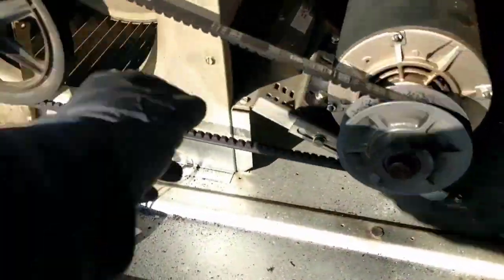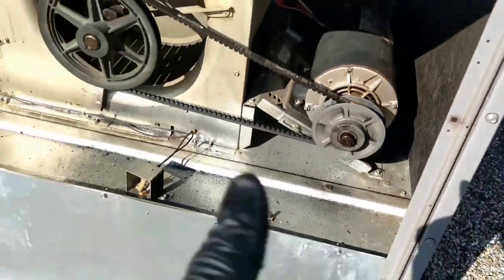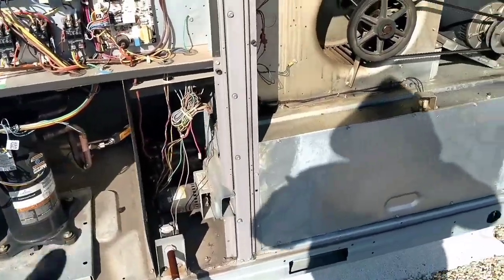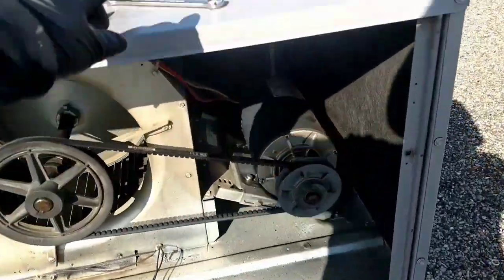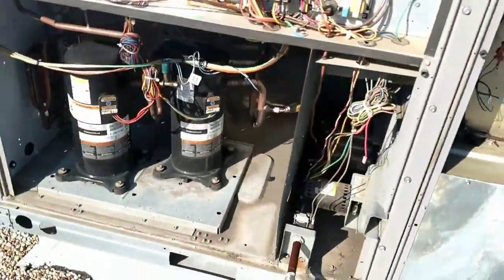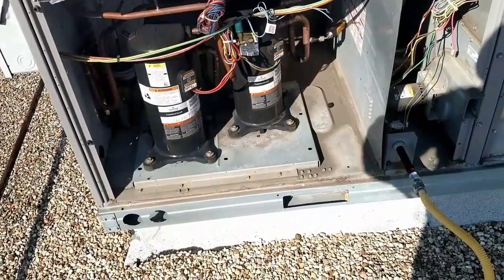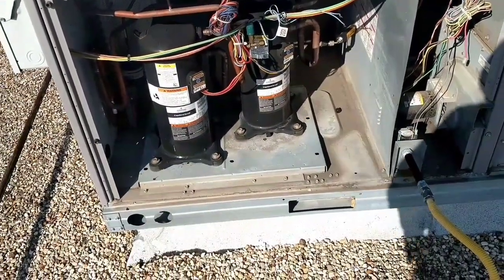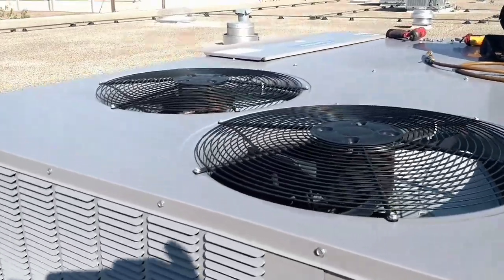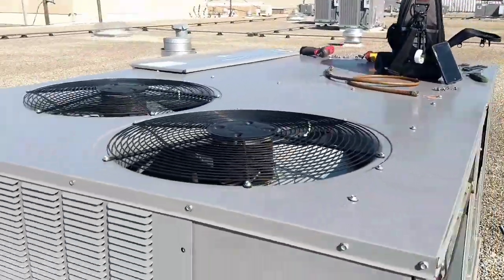What I'm going to do first is adjust this belt. Once I get it up and running, I'm going to use this hose to dump some of the high-side liquid into the suction side just to close that pressure switch. That will get my compressors running. I'm also going to recommend we do some sort of fan cycle control, because we've got two fans running full speed and we're just going to be dealing with head pressure issues.